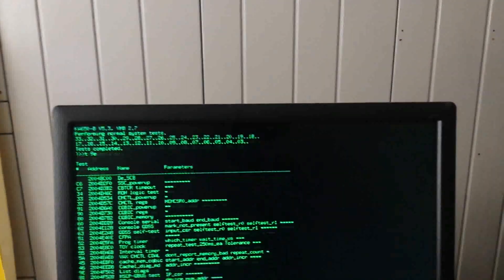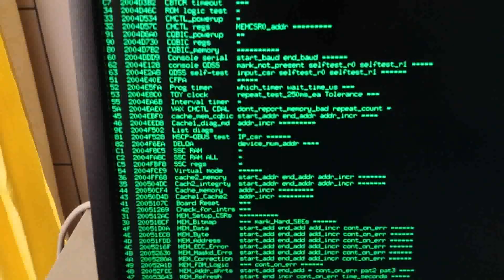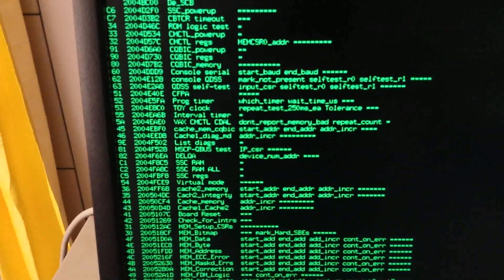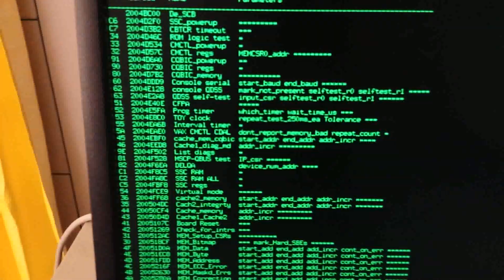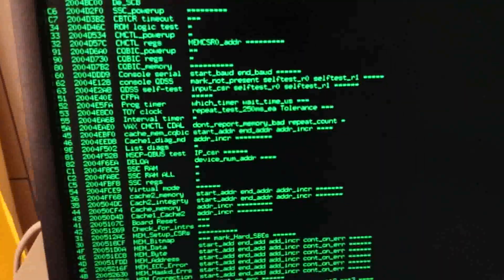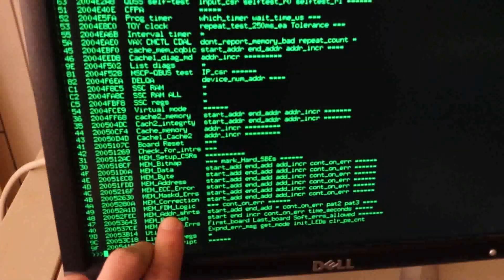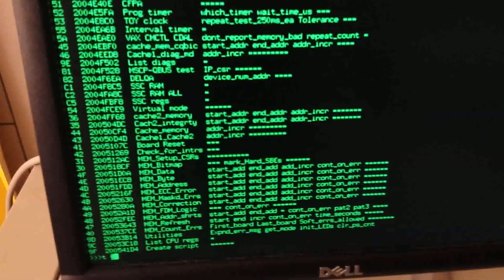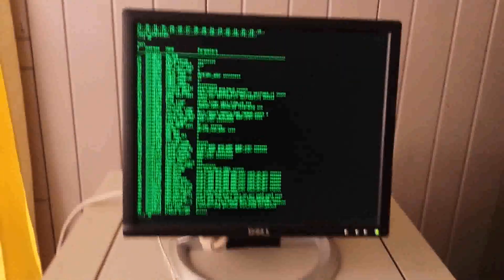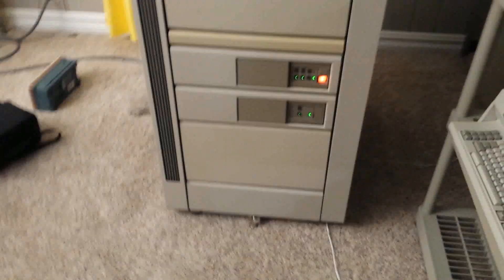Since this system has been sitting in storage for a while, it was a particular RAM test that it used to fail before I fixed the RAM card, and I think I'm going to run that test because it seems to be a little more thorough than the normal power-on self-test. It was this Mem Adder Shorts test here, so I'm going to run test 48 — this takes a while to complete. So while that's running, yeah, that's the whole rack back together after moving.